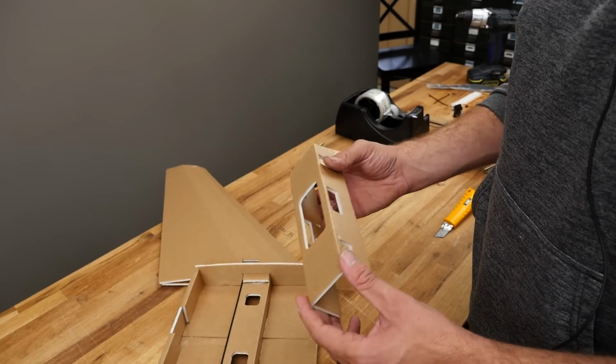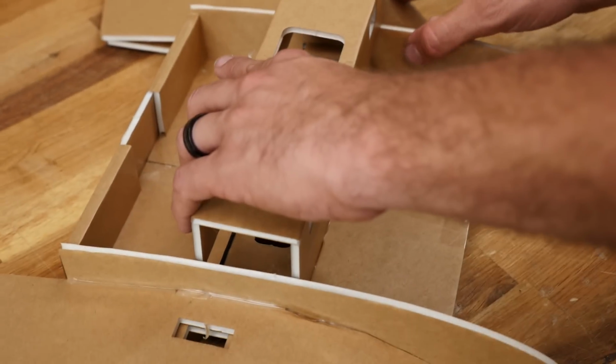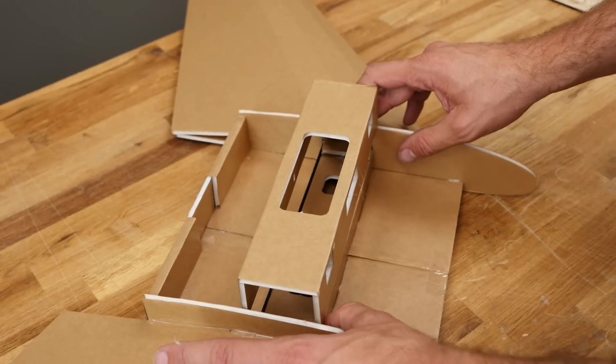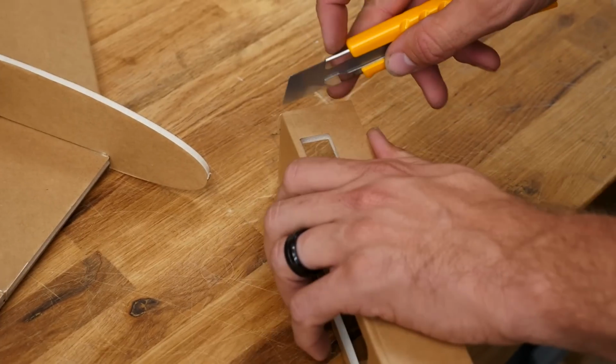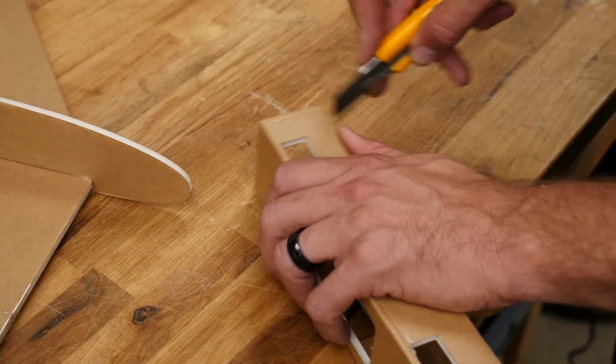So now it's time to bring back our secondary spar. Now this secondary spar is going to fit right in between here. And we're going to want to adjust this. It's purposely about 1/4 of an inch long, so you're going to need to adjust this unless you're scratch building and it came out just perfectly. The reason we do this is everyone folds these center wings just a little bit different. We want plenty of room for adjustment to have a nice tight fit. Tight fits are strong fits. So we're going to take about the thickness of a foam mount.